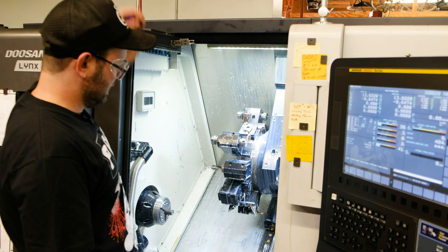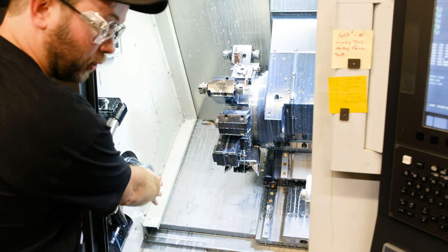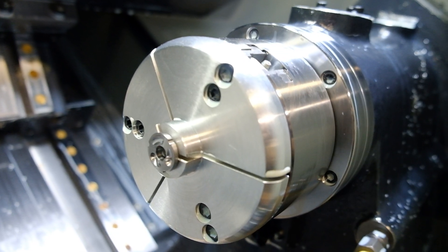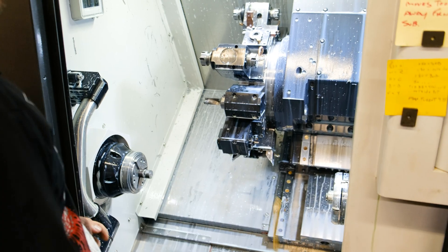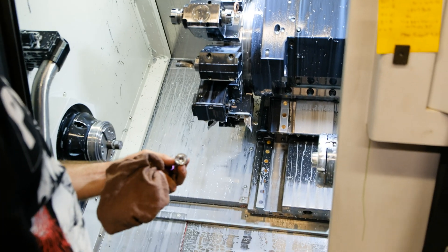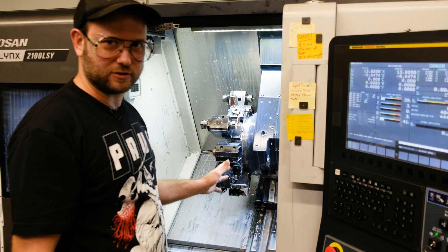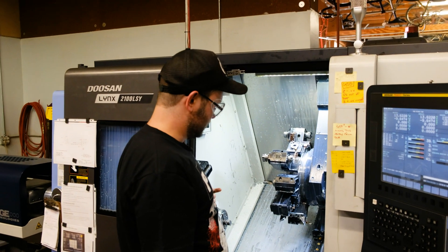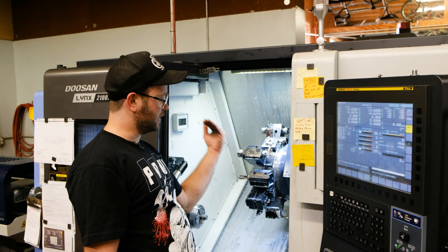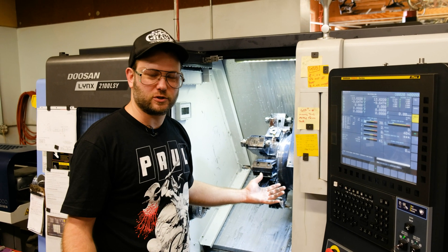Let's take a tour of the inside of this thing. This is a lathe — it's got two spindles; this thing spins and this thing spins. This is the four-foot bar, our raw bar stock, and the bar feeder is behind us. This is our sub-spindle, which is currently locked — it has disc brakes on the spindles for milling. There's actually a finished part in the spindle right now, and I have two jaw chucks. There's a little ejector in here that'll spit this out into the parts catcher. What makes this lathe a little more interesting is it has a Y-axis. Most lathes are two-axis — Z and X — whereas this one also has two Z's because it has a sub-spindle, which is called the B-axis. C is around B and Z. And Y kind of comes out at you. You can do milling because the mill is usually three-axis or more these days — X, Y, Z — the Cartesian coordinate plane.